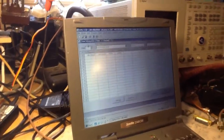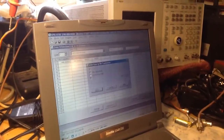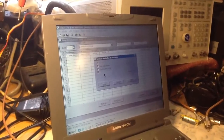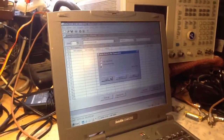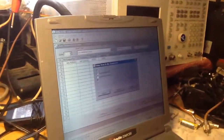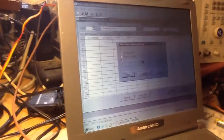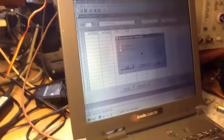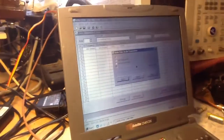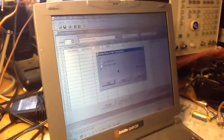Come up here, select Program, and hit Write to Radio, then click Write. If this pops up and you get an error or an X, you need to go into the actual settings for time adjustment — consecutive write — and for FleetSync, MDC 1200, and NXDN, just select one for the ID numbers. That might be causing the issue.